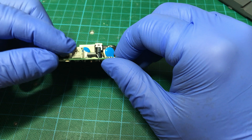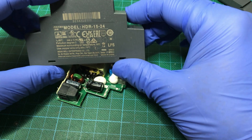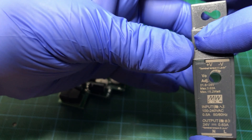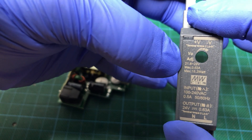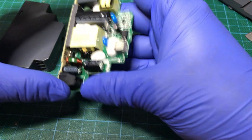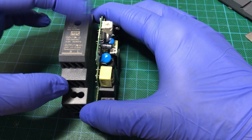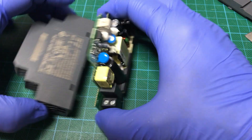There is also an adjustment here. We should check the range — it shows it here: you can adjust from 21.6 to 29 volts. So that is a very compact and small power supply, about the size of one fuse or breaker. I will trust this in my board.